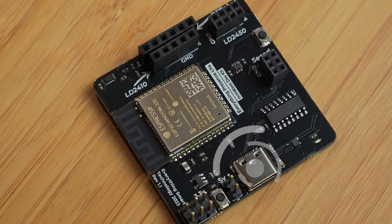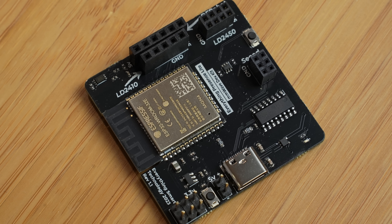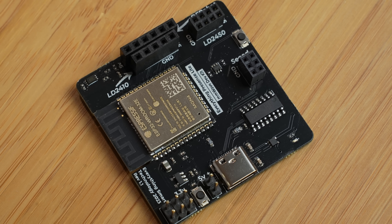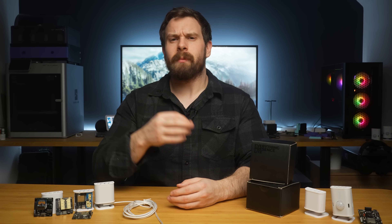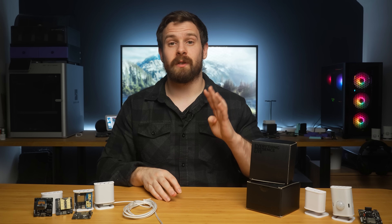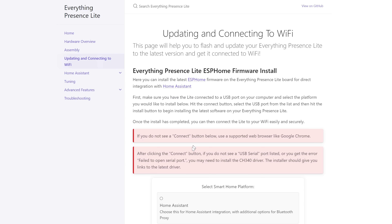Some other features: it has USB-C for power, or optional 5V header pins onboard if you prefer those instead. We also got rid of the need for a jumper pin to switch between them, which is really nice. There are also four GPIO pins like before if you want to add your own additional sensors and expand the Light. Max range for the included millimeter wave sensor is six meters with a 60-degree angle — be aware of sensitivity differences at that max range — and you can track up to three targets and add up to four different zones.